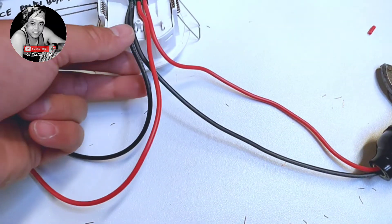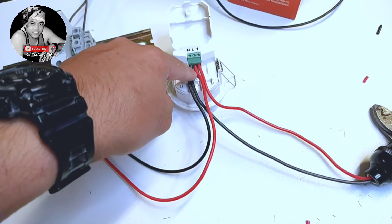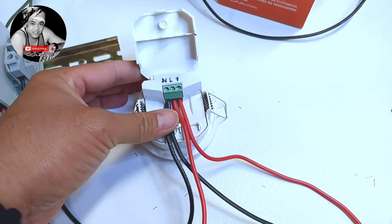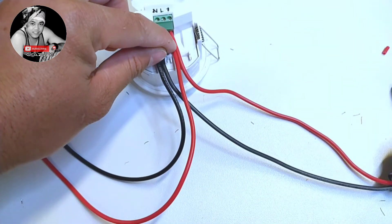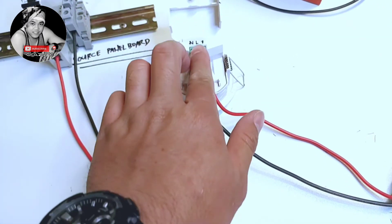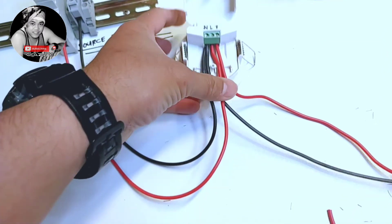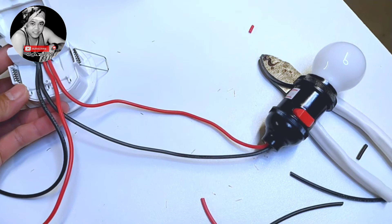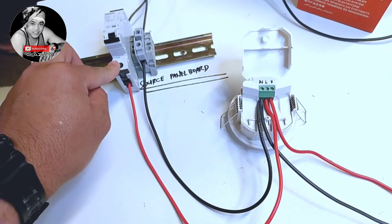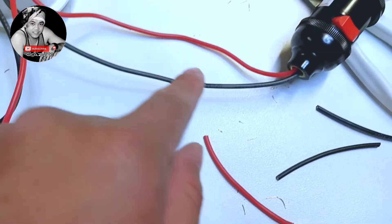The neutral will go only to main sensor neutral, and sensor neutral goes to our light. In this terminal in our sensor, there is number one — number one is output to our light. So when the sensor detects motion, it will become normally closed. When nobody is there, it will become normally open. The line goes to number one here and main line goes to our main source.